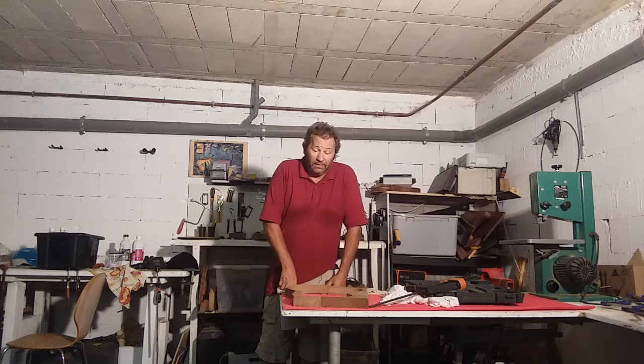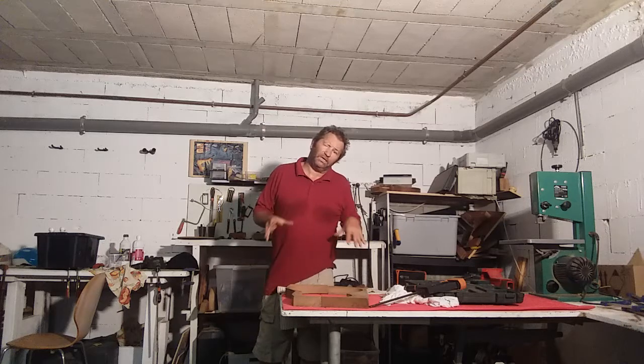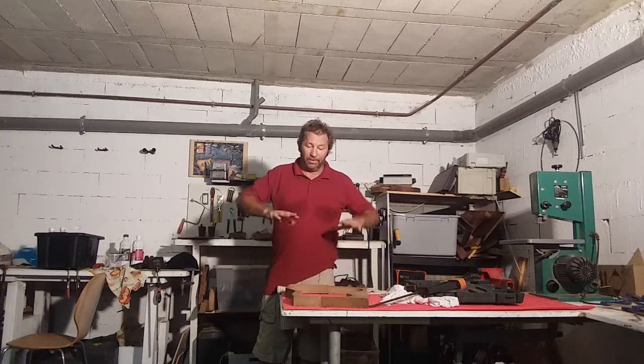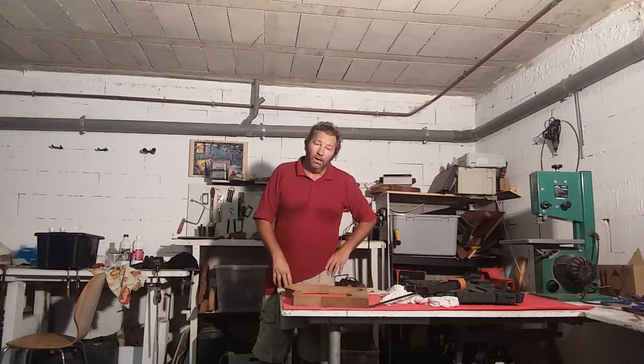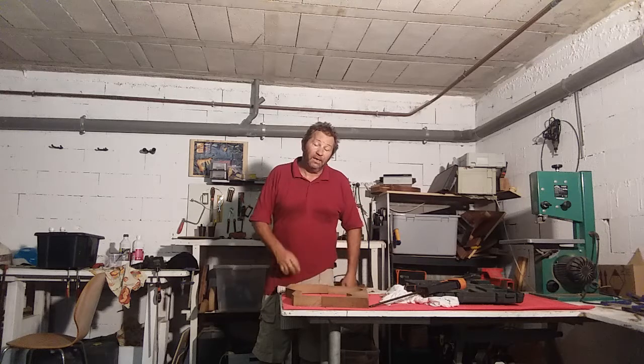Okay, I'll give you a quick update on what I've been up to. The last podcast I was talking about problems with routing and clearing out the dust and how to speed up routing. And I was talking about making a template that sits off the guitar 25mm. I've actually made one. It sits off the guitar 20mm and it works a treat. It's because it's off the guitar and the space underneath, all the debris flies out of the sides.